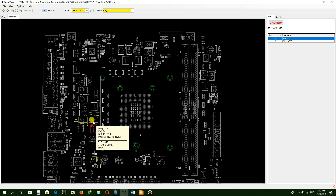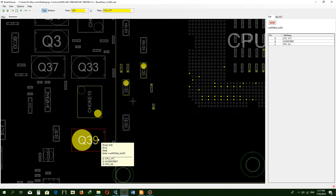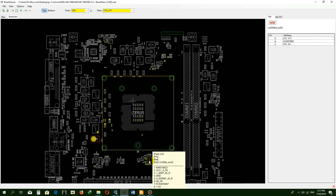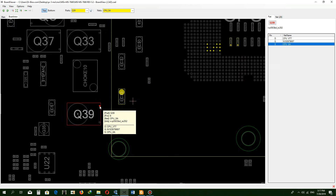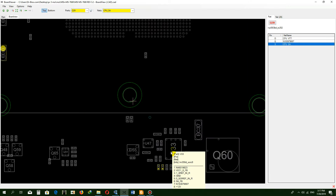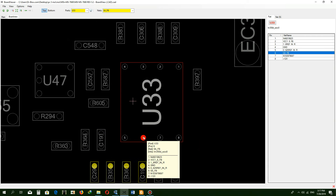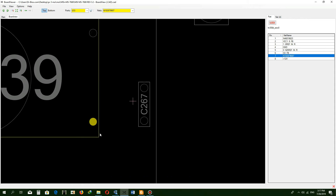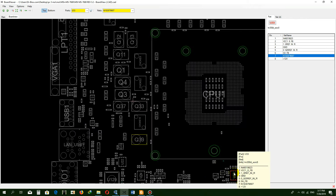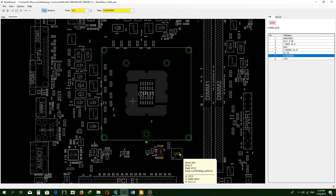The next sub-voltage is CPU SA voltage, generated by MOSFET Q39 and op-amp U33. Pins 5 and 6 of the op-amp are compared with each other, and pin 7 (op-amp output) controls the gate of MOSFET Q39. This circuit operates the same way as the 1.8V CPU voltage generator.